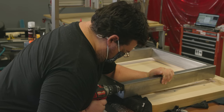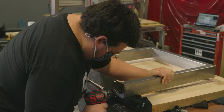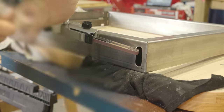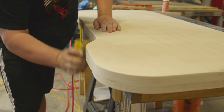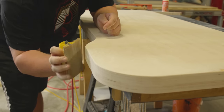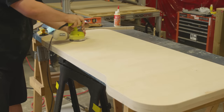Some more cuts were made so the cables could clear the legs and fit into the channels. Next up was making the pass-through holes in the leg for our cables — one at the top drilled out with a step-down bit and filed until it was big and smooth enough to pass cables through, then a much wider hole at the bottom to make grabbing the cables easier. To smooth the table for final assembly, we started with 120 grit sandpaper to knock down all the sharp edges and round the corners a bit, then moved to 220 grit.